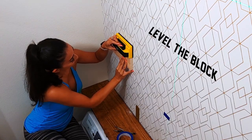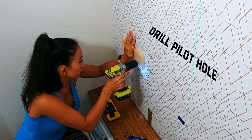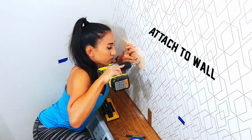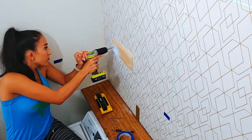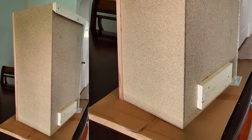To make your cabinet sit parallel to the wall, you will need a spacer block. There are two ways to mount it. You can mount the block onto the wall, making sure that it will not show from the bottom or sides of your cabinet. Since there is no weight on it, you don't necessarily need to hit a stud. The second way I did for my other cabinet is just to glue the block to the bottom of the cabinet — it's easier and you don't have to make more holes in the wall.